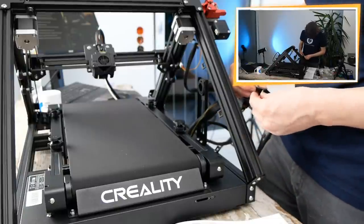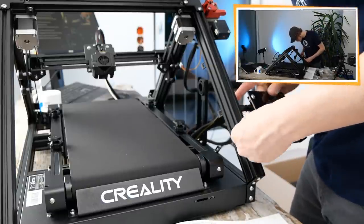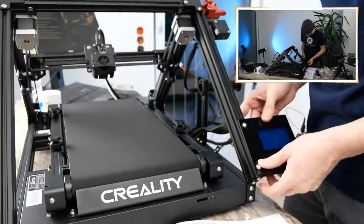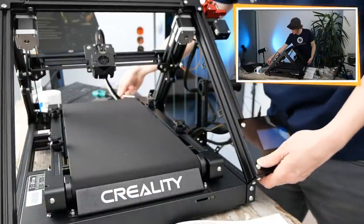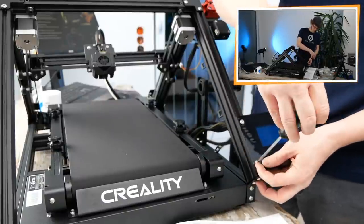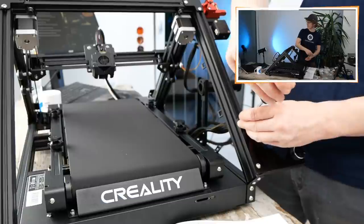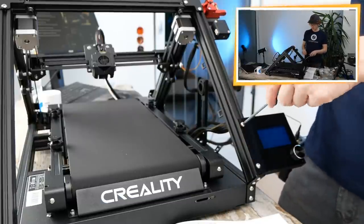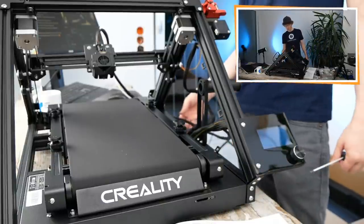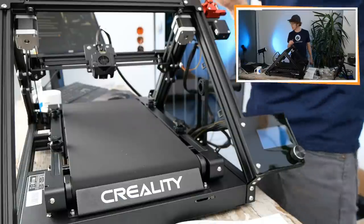Dylan is asking, can you use a standard slicer? No, you can't. There are modified slicer versions around that you need to use for those printers, and this is still kind of a disadvantage at the moment because you don't really have that many alternatives, and the Black Belt Cura is still based on Cura like 3.6, which is already pretty old, so you won't be having the latest features. But Idea Maker just teased this week that they are also going to implement belt 3D printing in Idea Maker.